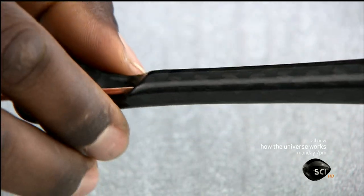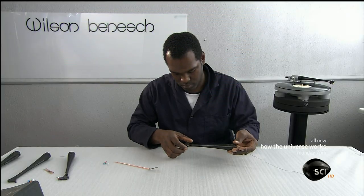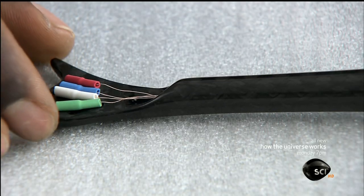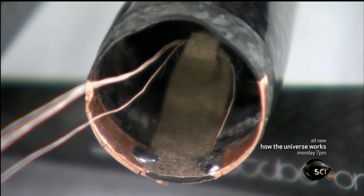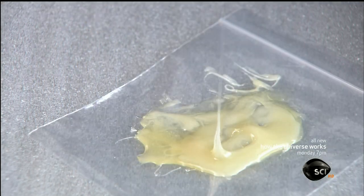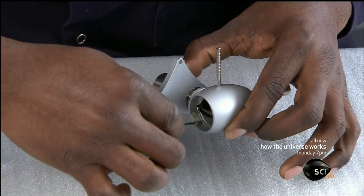The technician threads a pre-assembled wiring loom through the arm tube — special wire for high-frequency transfer. These wires have been encased in copper to keep out ambient radiation that would interfere with the tonearm's operation. The carbon fiber tube also acts as a radiation shield. He mixes epoxy resin and dabs it around the inner rim of the bearing housing, which has been equipped with the bearing.